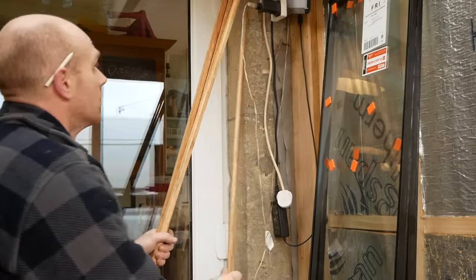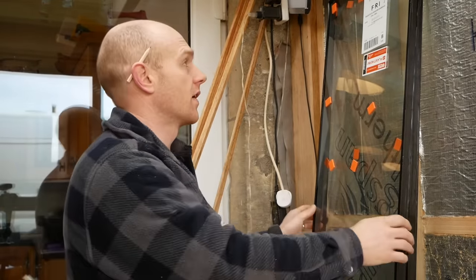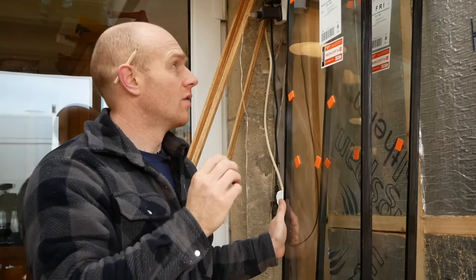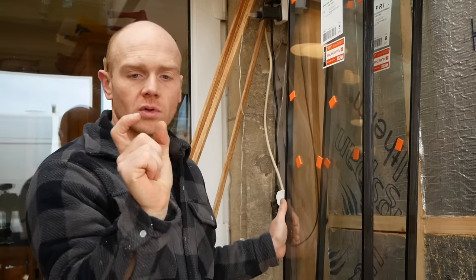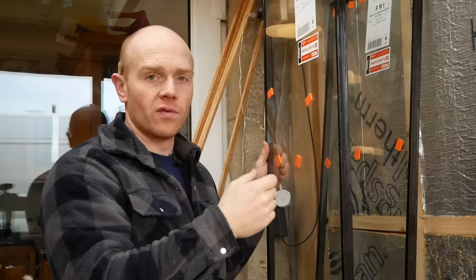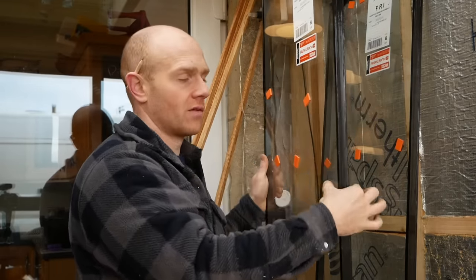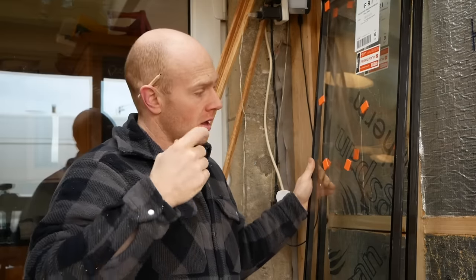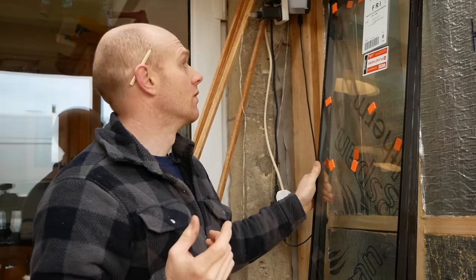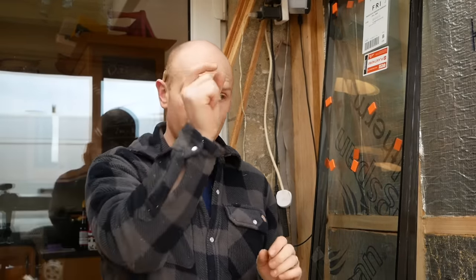So with the glass, the size of the timber frame kind of dictates how thick you can go. Conventional glass is usually, I think, 24-28, so it's 28 mil overall, or thicker, especially if it's triple glazed. We've had to go down to 24, which I think is probably the old thickness. Which means our space between our two panes of glass is 16 millimeters argon filled. But either way, it's a decent U-value for a porch, and it's gonna do the job just right and leave plenty of space for our beading on the outside.